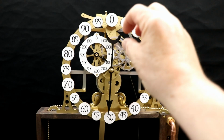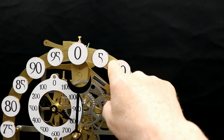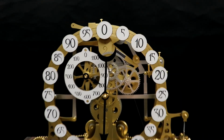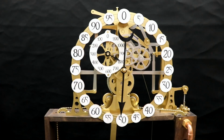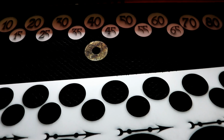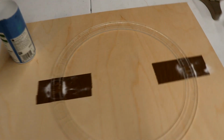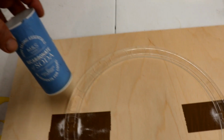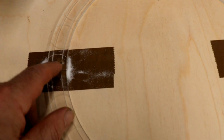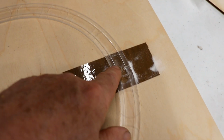Your brain just focuses on the annoyances, and yeah, the top of the 10 there where it didn't quite cut through the laminate because the power wasn't high enough and it left a little ridge. I think I'm going to have to make a new one. That's better. It's just lifted away. They're all cut out perfectly because I slowed down the cutting speed. And here's the other two bits. With the aid of a little bit of bicarbonate of soda, when you mix it with super glue, it fills all the gaps up and sets really quickly and very strongly and durably.